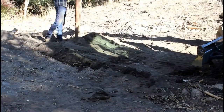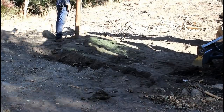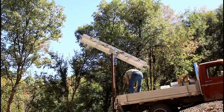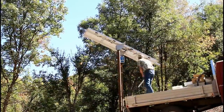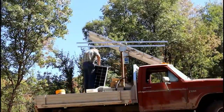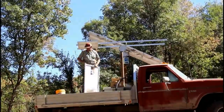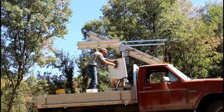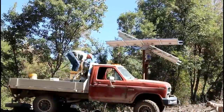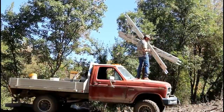Because I set my 2500 gallon storage tank a little bit higher on the hill than I initially intended, the fastest and easiest way to fix that was installing four more solar panels and modifying the pump slightly to make it basically what's called an RPS 800. I reached out to Rural Power Systems to find out if I needed to move the tank, and they quickly told me that they could help me solve my problem by just making a few adjustments.